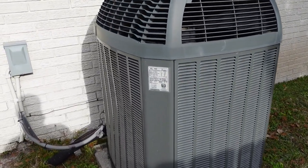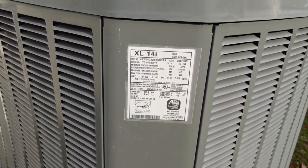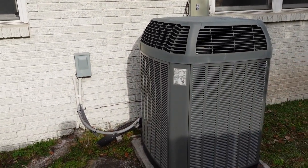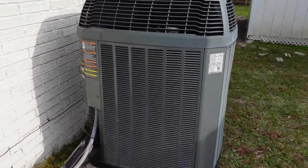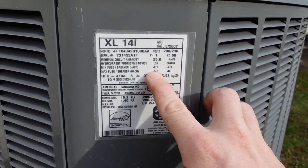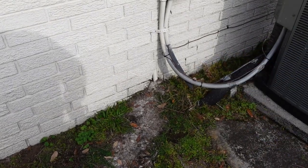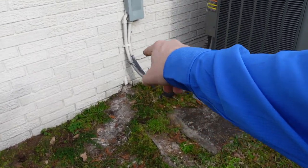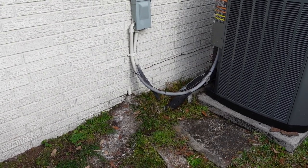We have a really nice Trane unit — it's a 2007, 3.5-ton, 14-SEER unit using 410A refrigerant, so just remember to document that. You want to be in the attic space to make sure the coils match the exterior condenser unit, because a lot of times they'll update one and not the other. Also keep track of your breaker sizes. Right here is your primary condensate drain line — you want this to extend out. You can see some high soil and excessive moisture here — an easy area to get termites, which we'll note in the termite section and grading and drainage portion of the report.